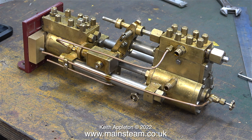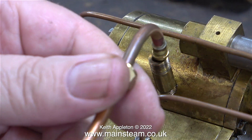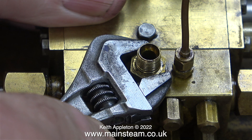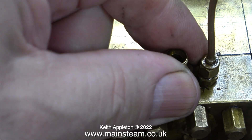It's time now to look at the steam inlet and exhaust outlet. Just in case any viewers are confused, I've marked on the image what does what. On the water cylinder at the bottom of the pump are the water connections; here's the steam inlet, and here's the steam exhaust. The problem is the steam exhaust is too small — it's designed for 3/16" pipe, which is a bit restrictive — and the steam inlet union is going to be replaced with the tap.